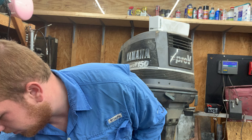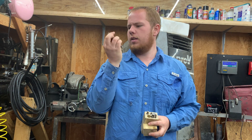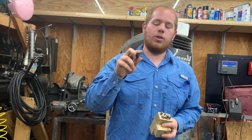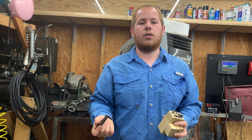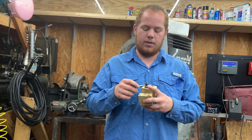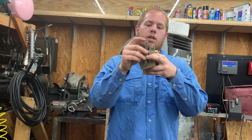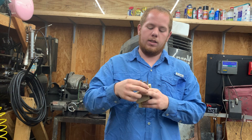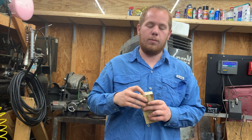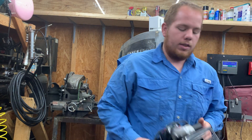Next, I made a little box for these because they only came in a plastic set. These are the Hansen square-tip screw extractors. You drill your hole, hammer these in, and turn clockwise or counterclockwise to extract the screw depending on the thread direction. Without destroying the heat treat, I grind down the tip so I can get as far into the hole as possible to grip the screw walls.